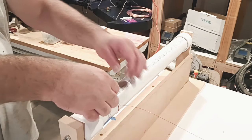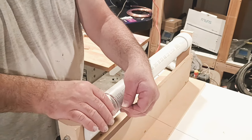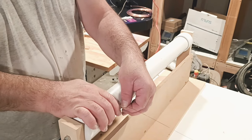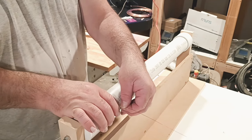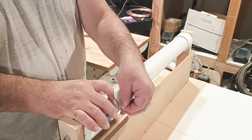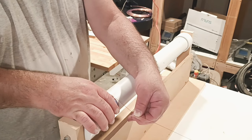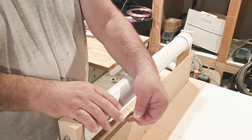This is one of the most important parts when you start this. What you want to do is leave some excess, wrap it around a couple times, put it on with the blue tape, let it stay there, then start winding. Now, as you wind it, keep pushing everything in tight until you can get around to where it's about double the width of your electrical tape. Right then, you stop, you tape it, and then you go ahead and tape the first run of electrical tape on that bottom part. That way it stays there no matter what. And your coil is set. After that, you're off to the races. It's time to see a big fat guy move at what, 6 times the speed? Let's go.